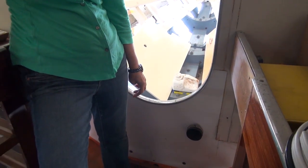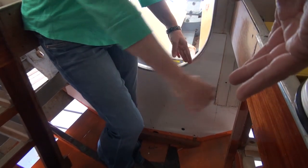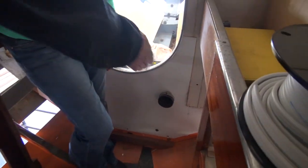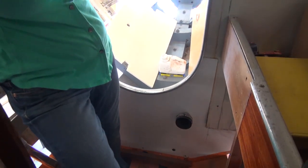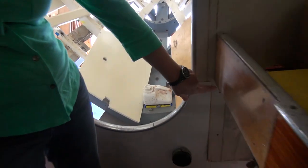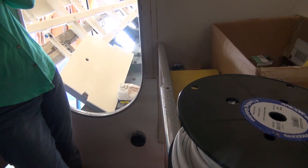We'll plug it with a big donut and move the vent inside the cabinet. This little cabinet face will have a bottom shelf and about halfway up another shelf, so this hole has to go anyway. The door would open this way — you don't want a tube there. So we get rid of that, and now it looks like a good thing to do: put the veneer up on here, not take this whole thing off, but work around it and slide it in through here. Then take the ring off and score the formica — take a heat gun and peel it off.